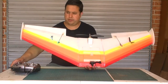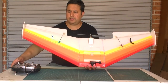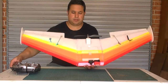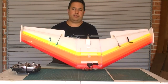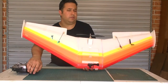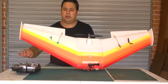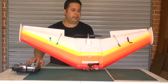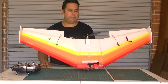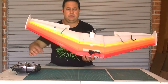Okay, so controls. Left and right. We have the elevons going in opposite directions, up and down. They travel together. So there's just a mix on the elevons to control the movement. The throttle is, as always, on the safety. So if I throttle up and down, nothing's going to happen with the safety on. Throttle active. Turn the throttle active, and there we have our 10-inch prop. So that's basically it. Put the throttle safety back on.